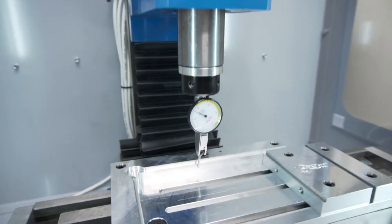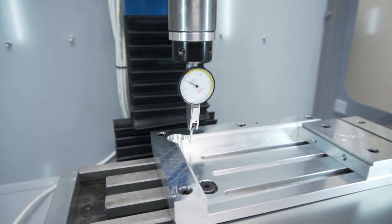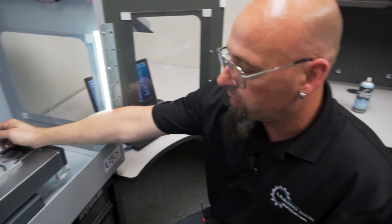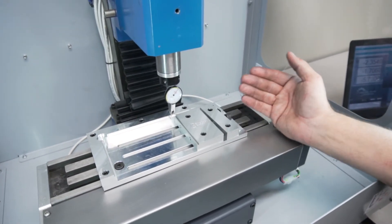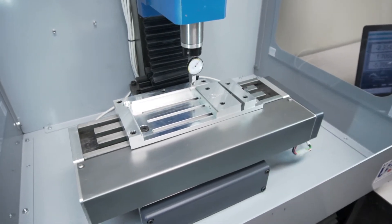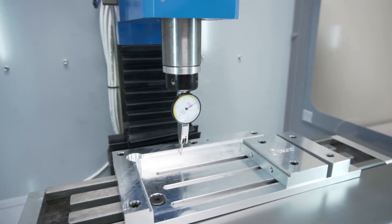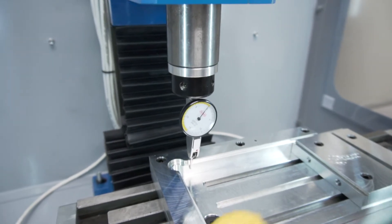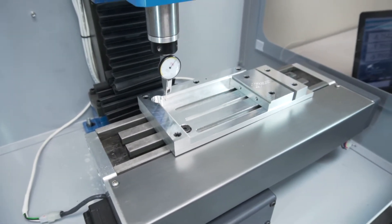That was probably too much, but we'll see. Give it a good snug and jog back to the left. Preload our dial and see how far out we are — we're back in ten-thousandths movements. This is very much a wash-rinse-repeat process. We've run it back and forth a couple of times. Now we have no more adjustment on the upper right-hand side, so we're going to lock that down. Then we'll zero it out — since the upper right is locked down, we jog left and instead of splitting the difference we move closer to zero, using our hammer. A little too far — there we go.